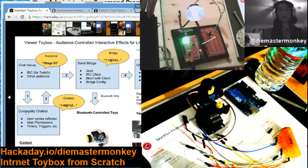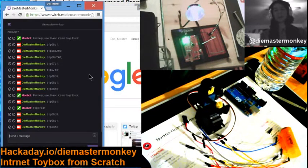So that gets intercepted by the, well, not intercepted because everybody else will see it too, but you tell your chatbot to watch for this phrase, stage 93 or whatever, and lamp on is what we're going to do right now. And then to respond to that in the chat venue with the low-level syntax to turn that thing on, right? So, in other words, to turn the LED off was B1P08D1 semicolon.